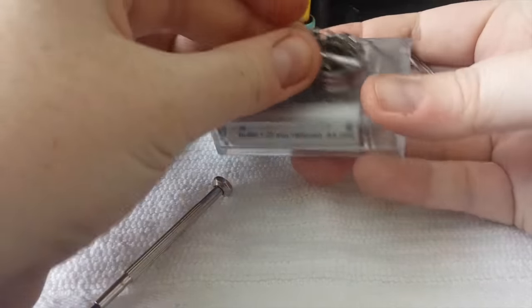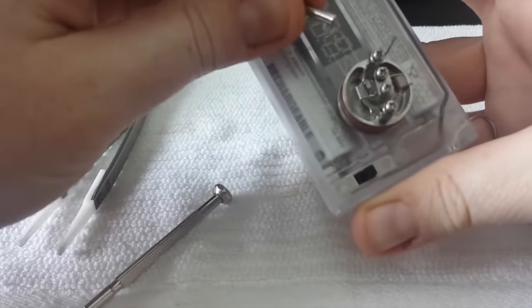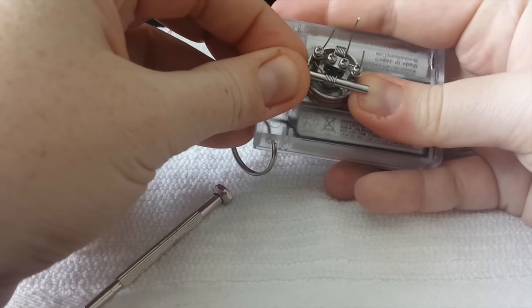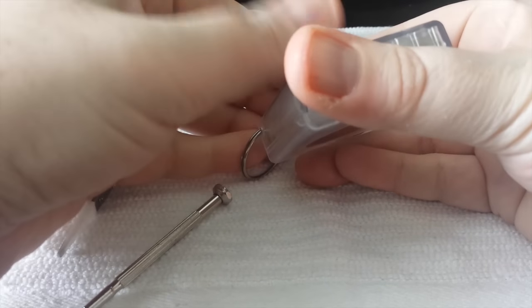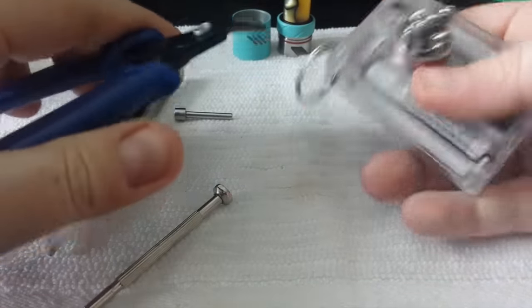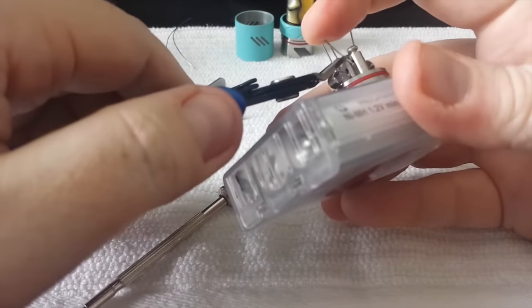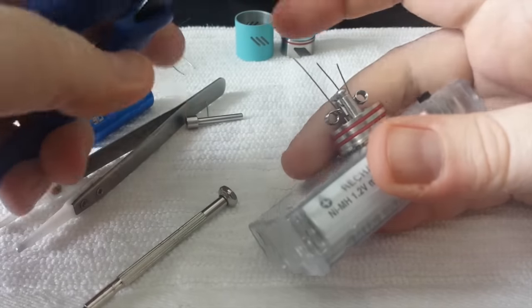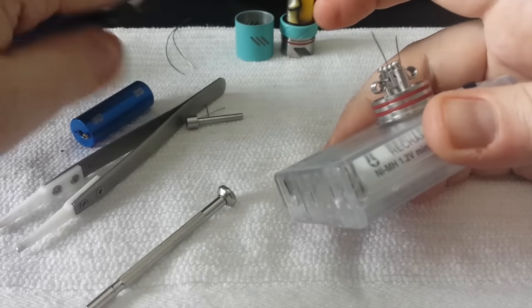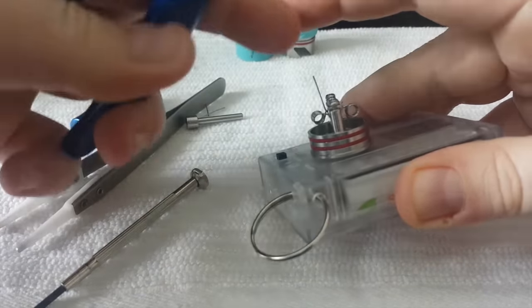Get those leads out of the way, pop them up, and take a look to see if you're in the right position. You always want to look at the height of the coils off the deck and make sure they're both centered the same way — the same distance from the posts. You want everything to be as uniform as possible between the two coils; it'll help them heat up the same. Now we're going to trim the leads. I always put my finger on top to stabilize it so the wire doesn't go flying, clip it, and discard the extra wire.